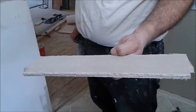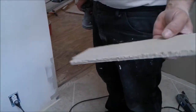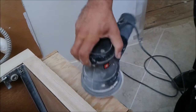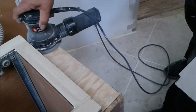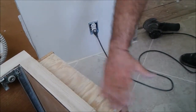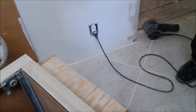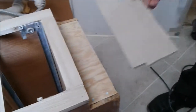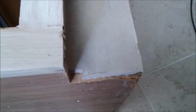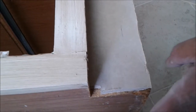On top of it we're going to install tile. Before I attach it to the three-quarter inch plywood, I'm going to make sure the piece is level. Then I'm going to clean it and vacuum it. I'm going to attach it here and put a little bit of space at the bottom. That space — I'm going to put a tile in it, and the remaining gap I will seal with a sealant that I can paint to match the color of the cabinet.